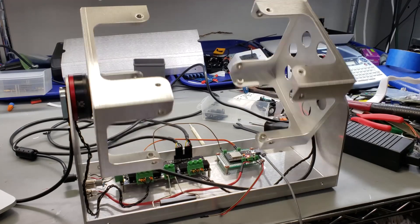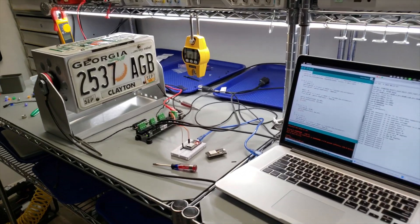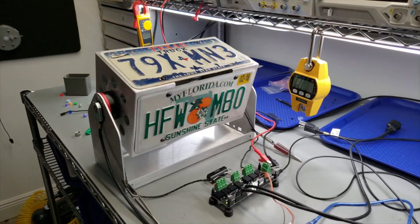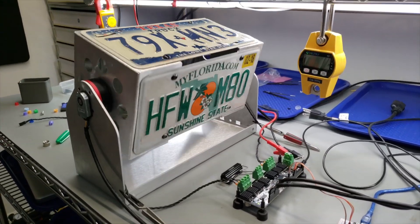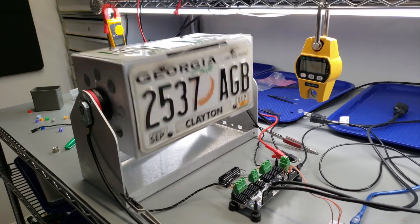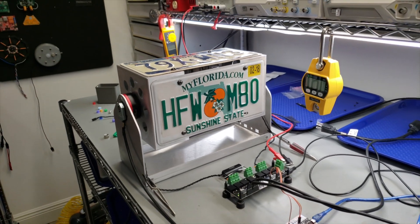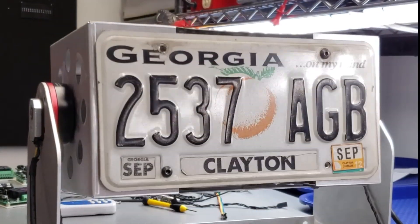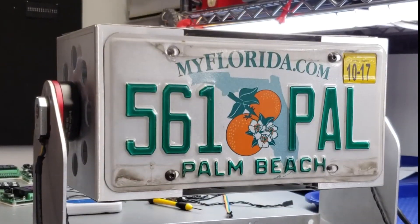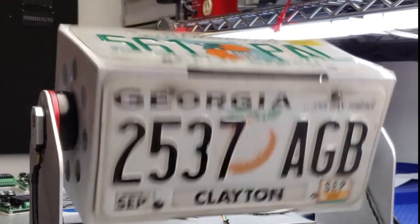At first I started playing with setting up one side of the machine, then it took a little more work to get the two motors synced together. Once I did that, you can see there's a little overshoot — that was basically because it was going from zero to whatever speed I set with a rectangular speed profile. It becomes a lot more smooth when I switched to a trapezoidal speed control, which ramps up to speed and ramps back down.